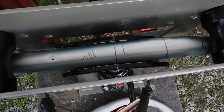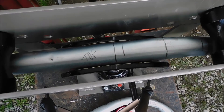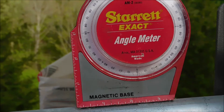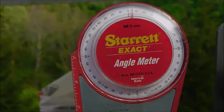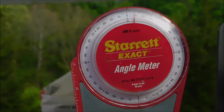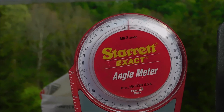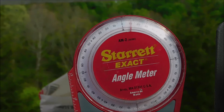I bent the middle first. I'm coming out here to this mark about three inches away and I'm going to bend it to 10 degrees. I'm going to take this side up till I read about 10 degrees, making our bends nice and slow — basically making three bends instead of one, because this machine likes to kink the pipe instead of just bending it. So we'll take it to 10 and then do the other side the same way.